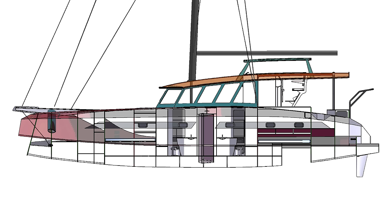Let's show you how these dagger boards work and where they break away at the bottom of the red cedar block. Here you can see an image of the side of SV Links. The dagger board casings exit the hull at the angled side just below the deck walkway, out the side of the canoes below the waterline but above the keel. Now let's superimpose the dagger board in that casing. When raised, the angled section is exposed, cut at an angle to reduce windage. When lowered to full depth, the western red cedar strengthens the board at the point where water pressure will try to bend it backwards or from the side as we sail.